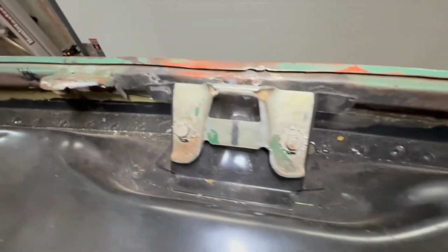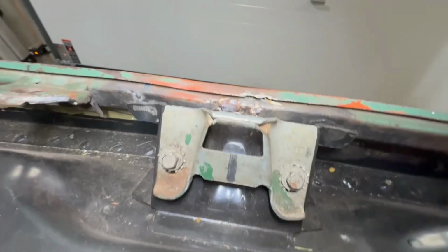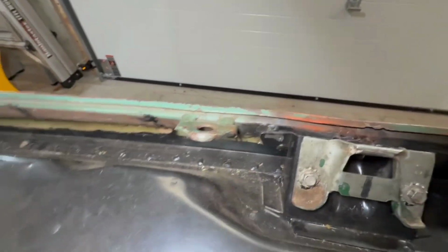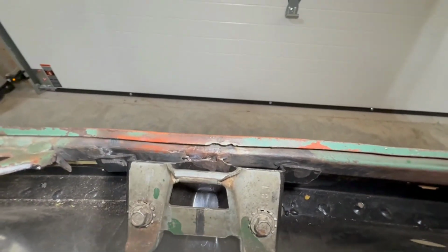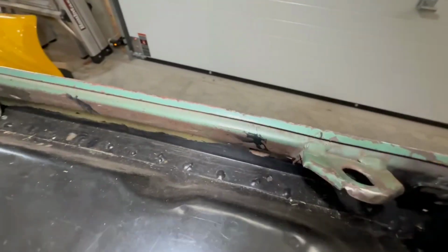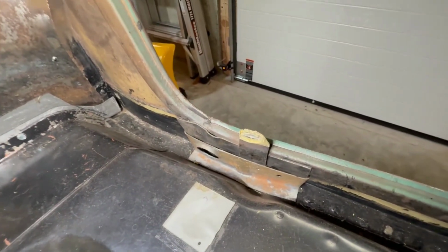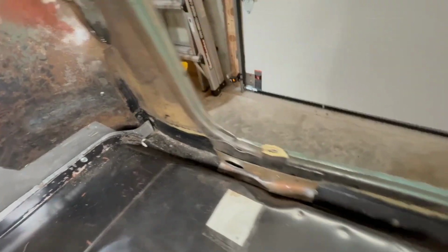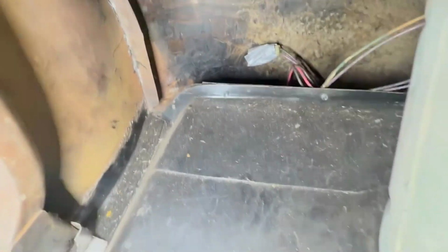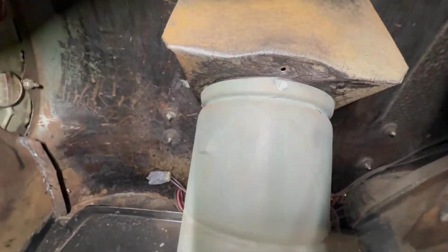trunk pan. There's the trunk latch, nothing fancy there, just welded back to the tail pan about where it used to be. That would be the new one that came with the trunk pan welded to the old tail pan. And here you can see the other bumper support and the trunk extension. And the other trunk extensions here underneath the fuel filler protector. That's just sheet metal screwed in for the time being.